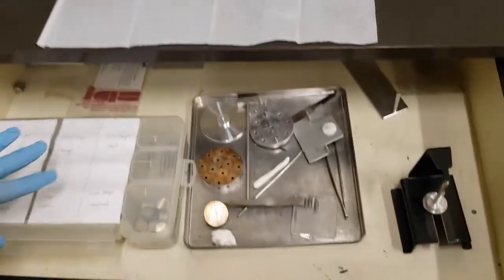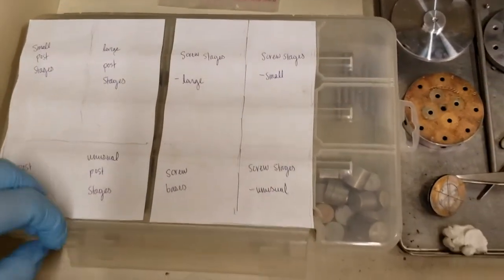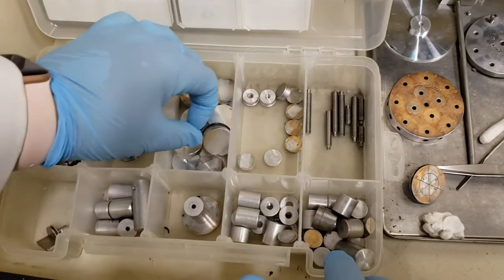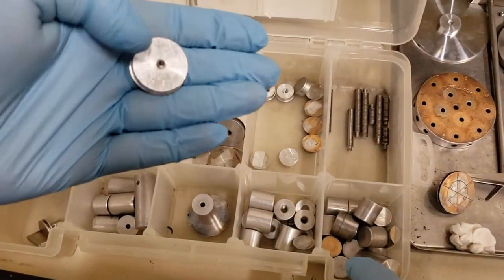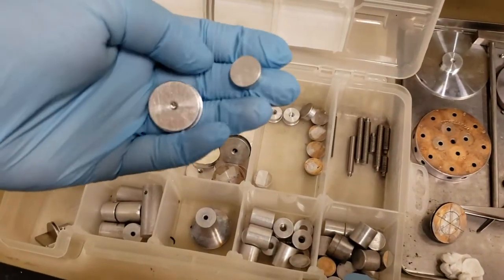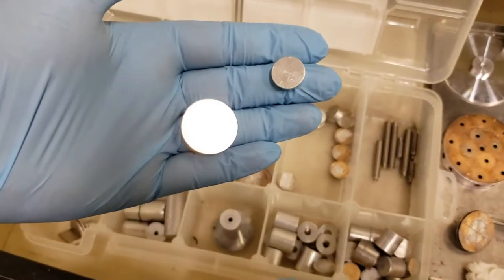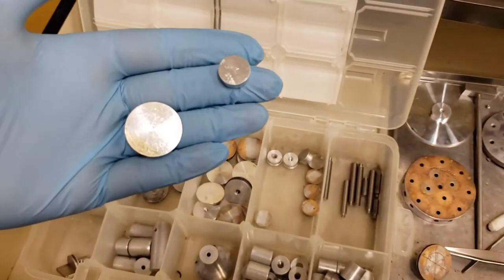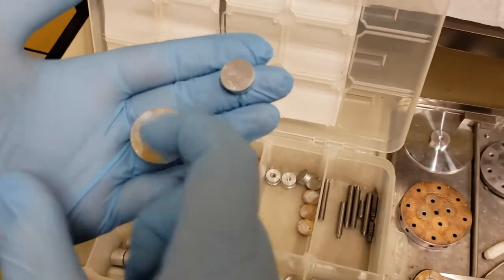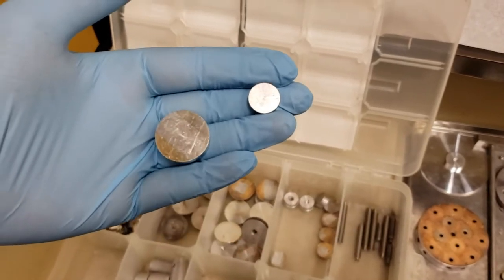In this drawer we've got a container full of stages. The screw stages in these two compartments are the ones that fit best into the TM3030 Plus SEM, our little tabletop one. They come in two sizes — big and small — and that screw fits into the base of the SEM. Choose whatever fits best for your sample. If your sample is significantly larger than the stage, you may need to reposition it or cut it down, since there are limits on how far in the X and Y directions we can go.